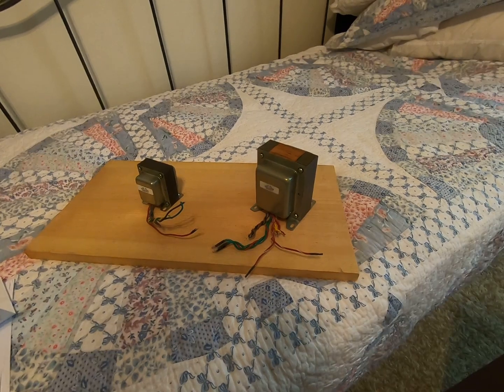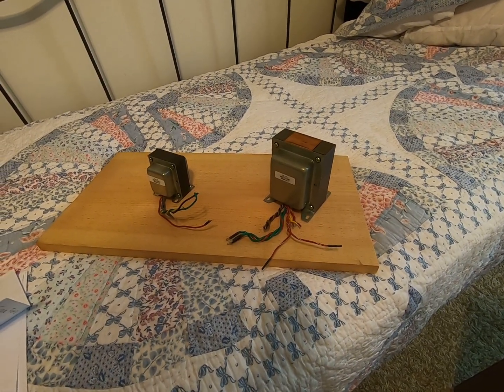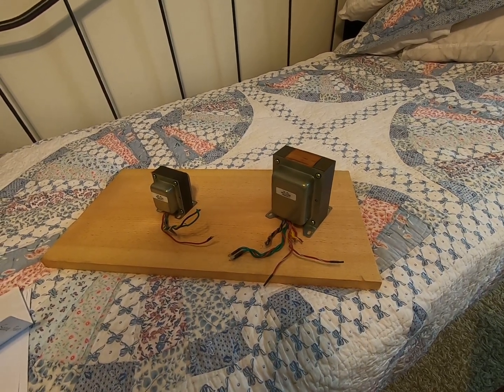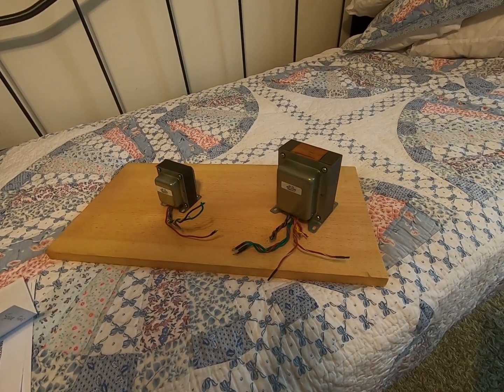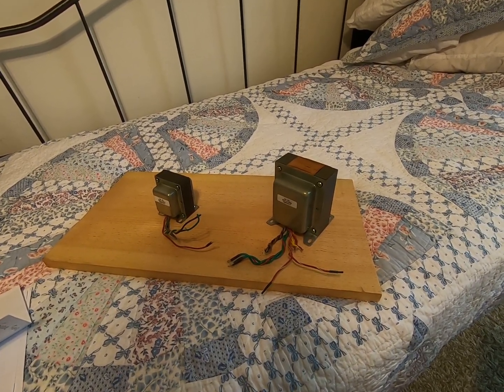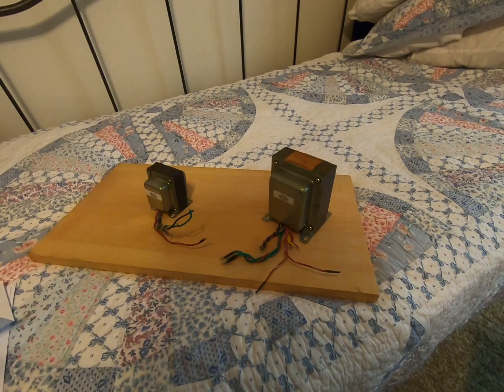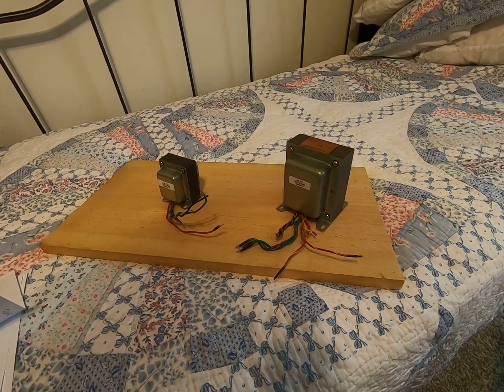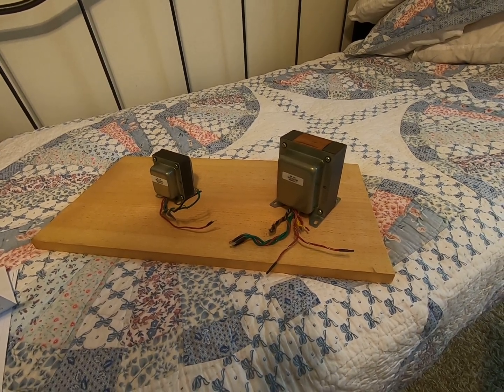So I started looking around inside of it. There was some smoke. Brad put these Jackson amps together with little boards on top of the rectifier tubes and all the tubes. That's where the plate resistors and things like that go. But part of that little board was smoked. You could see where the magic smoke came out. It was burnt. There was a resistor popped.